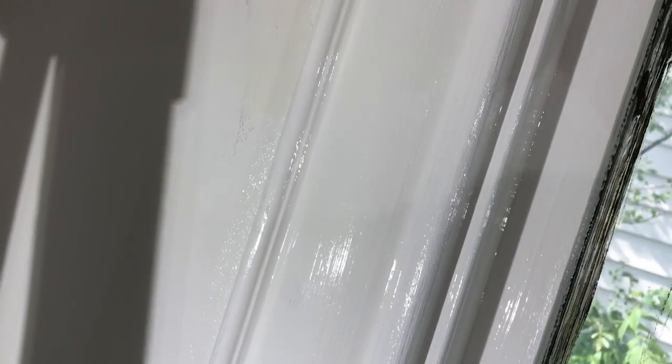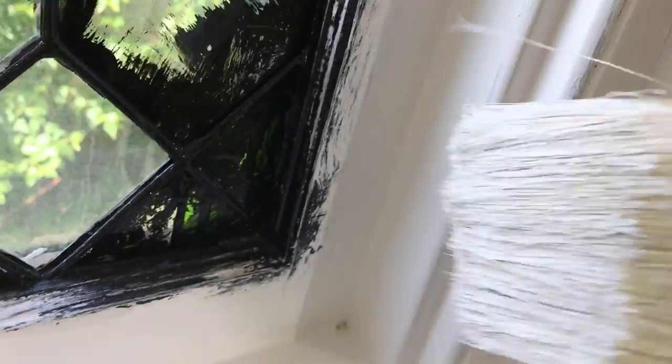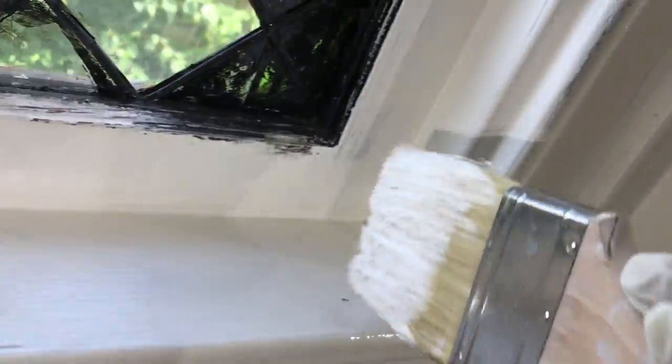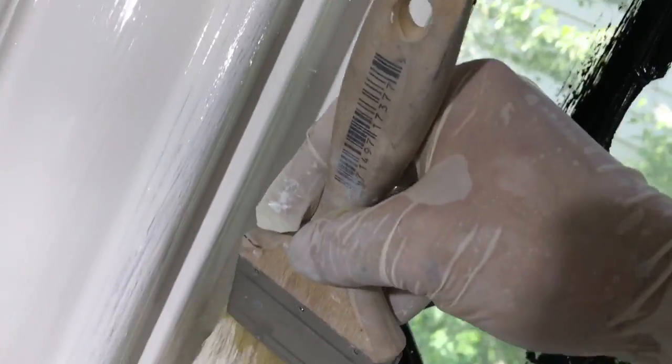Just make your lines as straight as possible; go with the grain. It doesn't take a lot. Remember I put lamp oil in this and it's going to lay down nice. Always go from top to bottom. I'm not expecting to get full coverage on the first coat — I'd preferably have my lines straight with no runs. If you go too thick you'll get a lot of runs and then you have to sand them out.